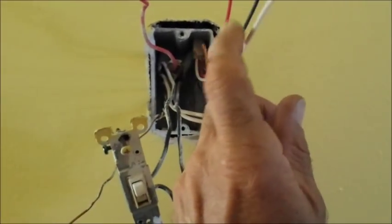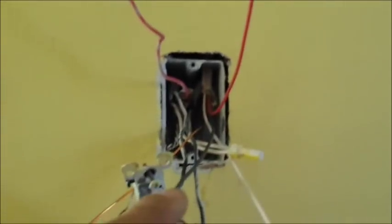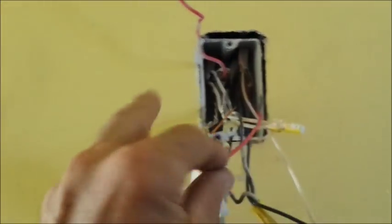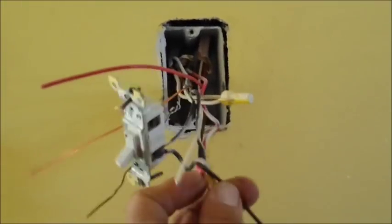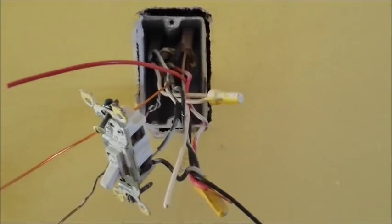I'm also going to add the neutral in with this group of neutral wires. The black wire — we want it to represent continuous power, so we want it up to our new box with continuous power. The fan, no matter where the switch is at — off or on — will have power to it. So we're going to put it down here with this power wire. Our red wire is going to run to the light, so we're going to put that back on the switch the way the other one was before. When the switch is on, the light will be on; when the switch is off, the light will be off. This wire here we're going to wrap right back up with this power wire so that it feeds and powers up the other half of that outlet.